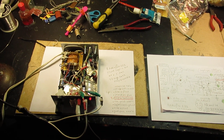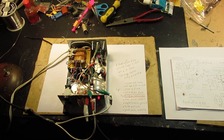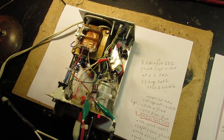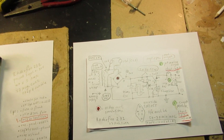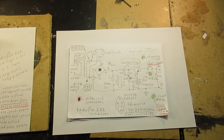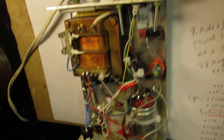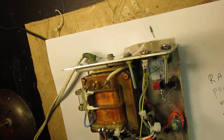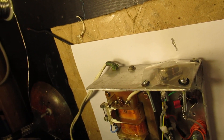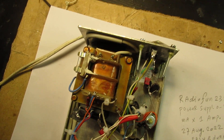For hobby purposes you need a good quality power supply, and there are many power supply videos on my YouTube channel. The reason I'm publishing this again is that this power supply has served me for approximately 15 years. I made a mistake in the past by not mounting the 2N3055 on the heatsink, so it burned out yesterday. I rewired the whole circuit and it's perhaps interesting to show it here.